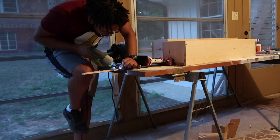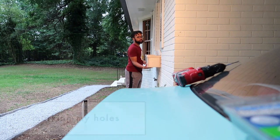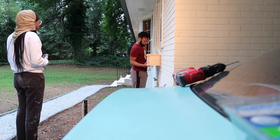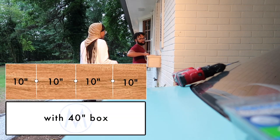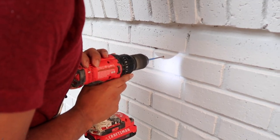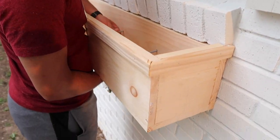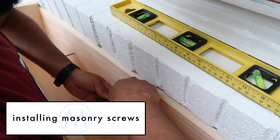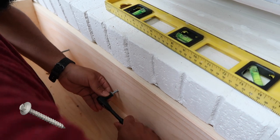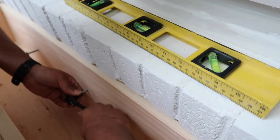A miter saw would be the best deal, but make it do what it do. I marked my holes using a drill bit — I measured halfway up through the back and tried to get three consistent, evenly spaced holes. You just divide by four and you know where to mark your holes. You always want to make your holes a little bit tighter than your actual bolts. These masonry screws have a little lip on them, which grabs the wood better so it's not just screwed in loosely — it actually grabs the inside of the back of the box and holds it really well.